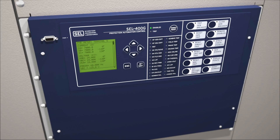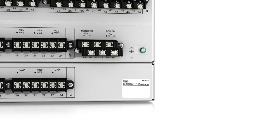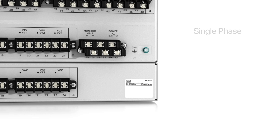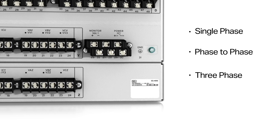The other single sets of currents can be used to do either a restricted earth fault on the generator GSU, or they can be used for split-phase protection. The voltage terminals can be either single-phase, phase-to-phase, or three-phase terminals.